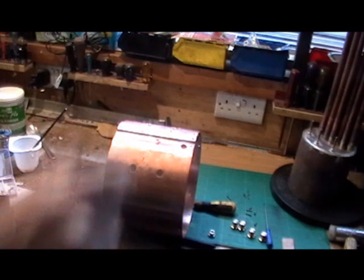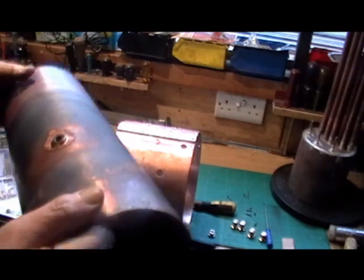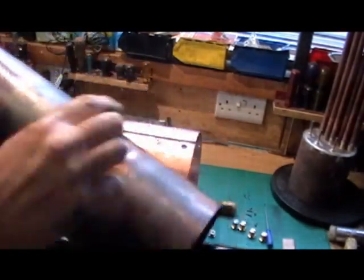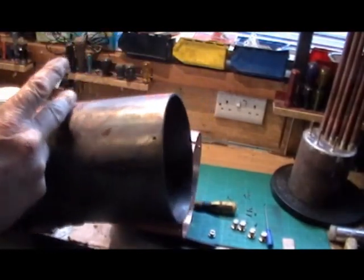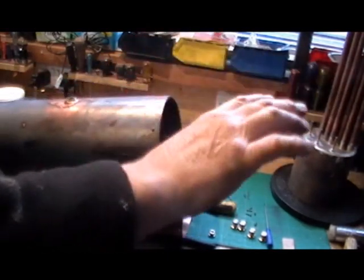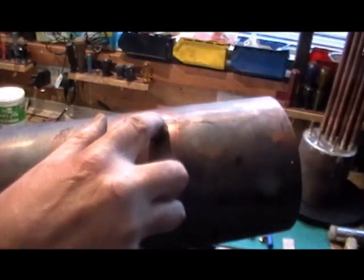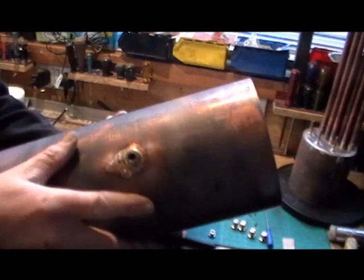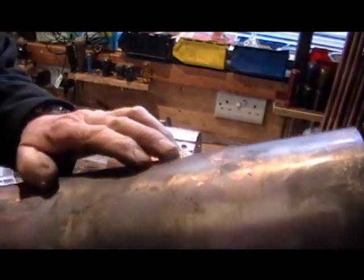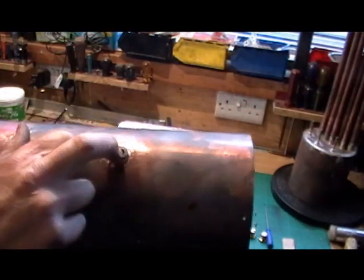I've made a start with this second part of my silver soldering. I decided to put the clack valve bushes in while the barrel was off, without it being assembled, because there's not going to be as much heat going this way — it's all going to be concentrated on this side. So I've managed to get these soldered in. I think I've brought a bit too much solder on one side, but better to have too much than not enough. My clack valve bushes are in.